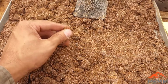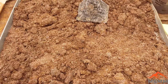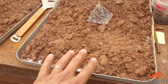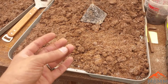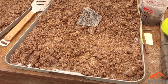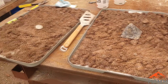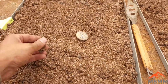Because copper is fairly low reactivity, and gold and silver are as well, I'm going to try and sulfidize the more reactive metals in here, the zinc, the iron, and some of the tin and the lead. Hopefully we can purify our copper some, get into the 95% copper range with a little bit of precious metals. I know we won't get all the lead and everything out of this, but if we can reduce it quite a bit,